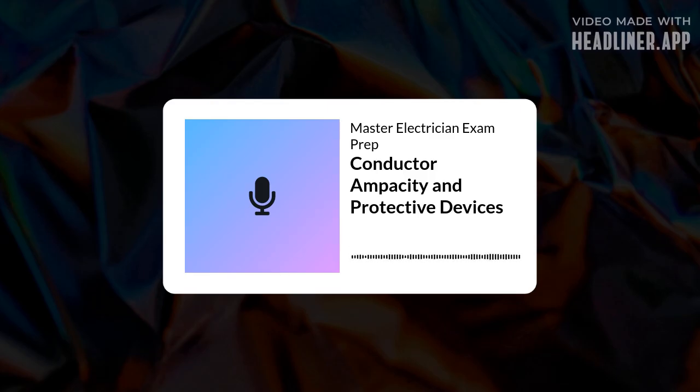For circuits over 100 amps or using conductors larger than 1 AWG, you might find 75 C terminals are more common. But you still have to check and use the appropriate ampacity column. Ignoring terminal ratings leads to overheated connections, insulation damage right at the termination, potential failures. Definitely a key detail. Okay, sizing conductors for branch circuits now. Basic idea: size for the load, protect with an OCPD.